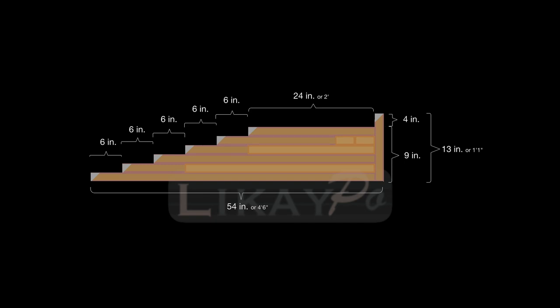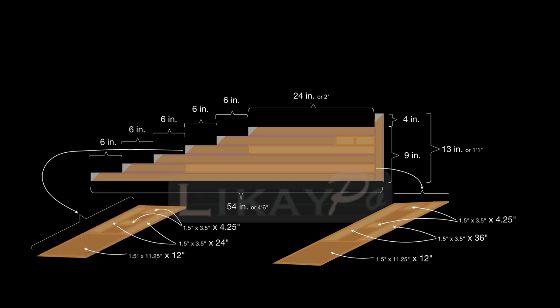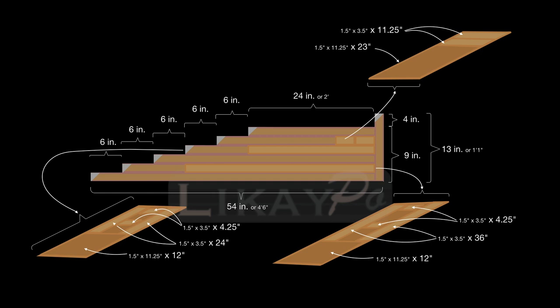This is to save on materials and make the ramp a little bit lighter, although it will still be surprisingly heavy. For the 2nd plank, I'll just cut a foot for the front, and I'll use 2x4 to fill in the rest. And I'll do the same thing for the 4th plank. As for the 5th plank, I'll fill in 2 pieces of 2x4 across the rear end.